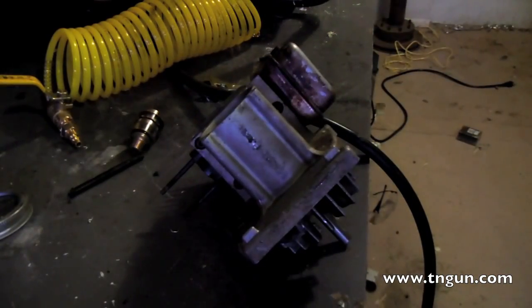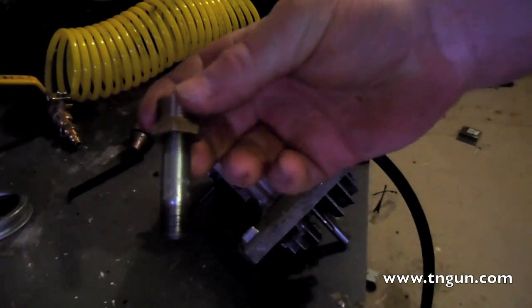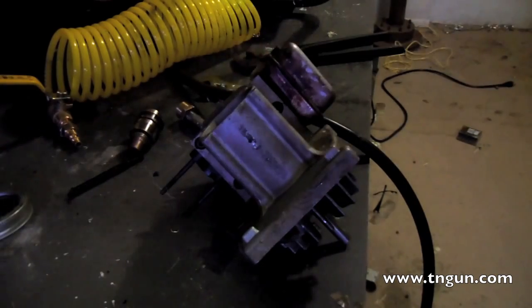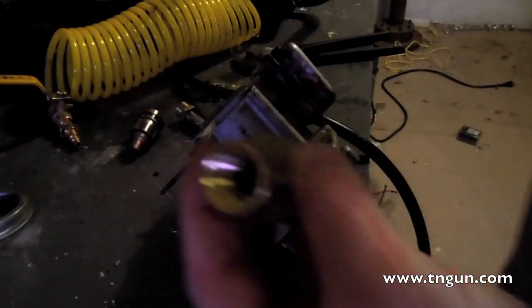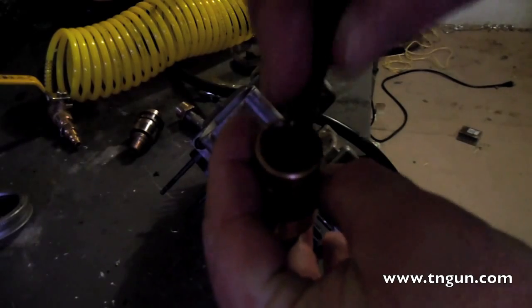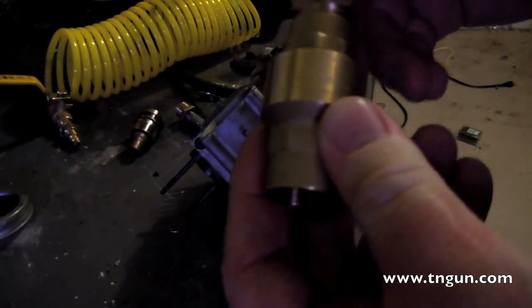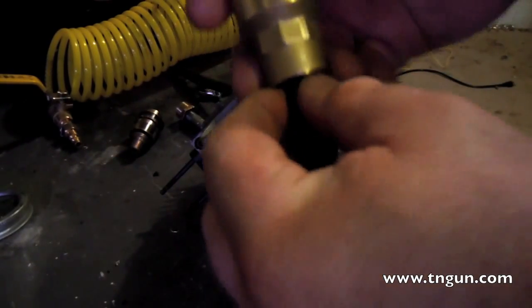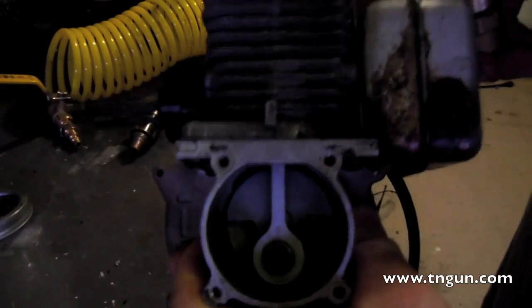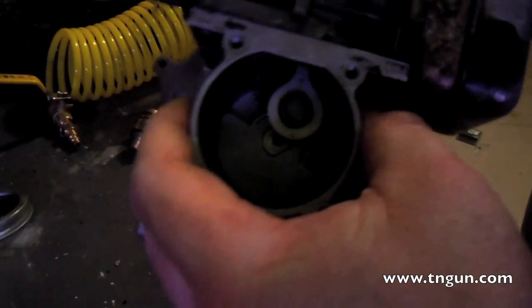There's a serious lack of tools, but this nipple just makes up the distance. Here's a check valve — and inside here there's a little spring, can you hear that? So what happens is steam comes in here and it pushes that valve closed. There's a spring in there, and since it's closed it's pushed all the way down, so your piston is at the bottom.